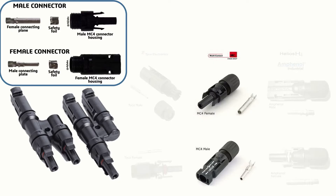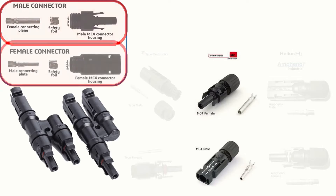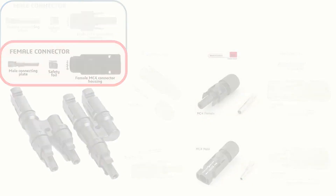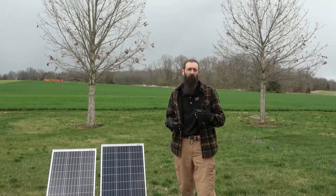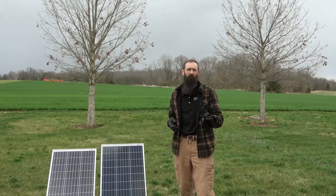As a precaution, pay particular attention to the male-female notation on these couplers, as some retailers may refer to the plastic housing of the actual connector while others will refer to the metal contacts within the plastic housing. As we've discussed in previous videos, the male plastic housing contains a female metal contact, while the female plastic housing contains the male metal contact. So just make sure you understand which is which. For today's video, we'll use one of each — that's a two-female-to-one-male, and a two-male-to-one-female.